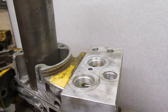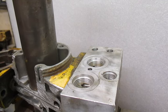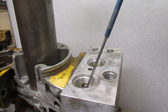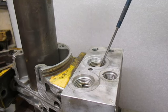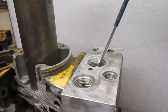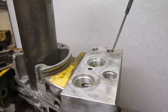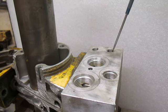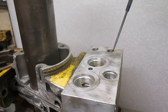As I was saying, the fluid leaves the gear pump through this passageway, passes through the high pressure filter into the B valve, which is not energized, passes through the C valve, which is also not energized, to this port here — where you have a swivel hose in the original correct configuration — out to the passenger side angle ram, making the plow go left. Left is default.